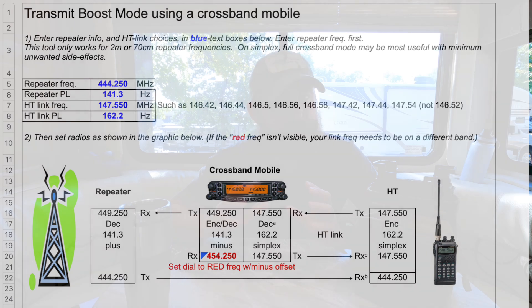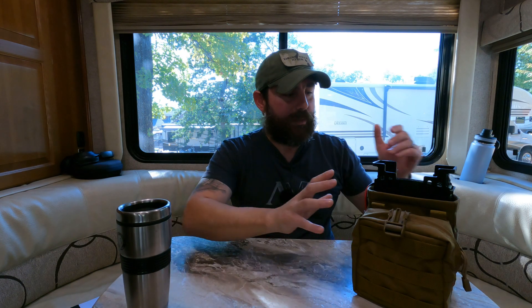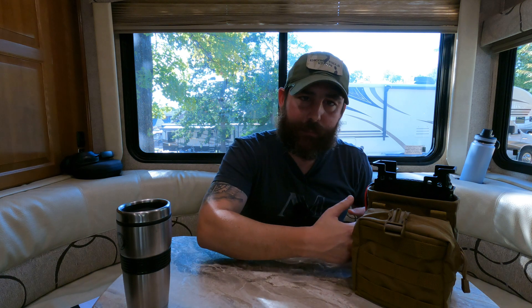But the main takeaway here is the reason why I chose this 8900 for a manpack step-up is its ability to have the dual VFO capability and the ability to do either full crossbanding or half duplex crossbanding. And again, everything's a tradeoff, right? So we go down this route, and now obviously we have a heat problem to deal with and a power problem to deal with, but a lot of value in going in this direction.